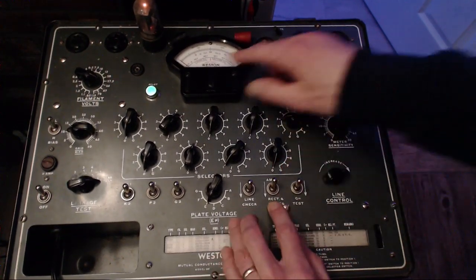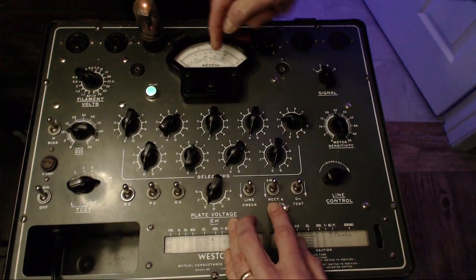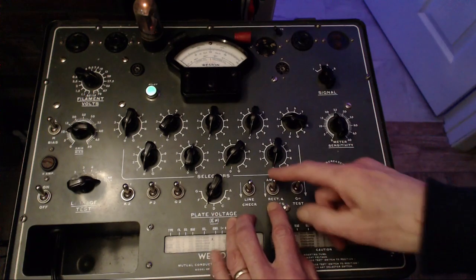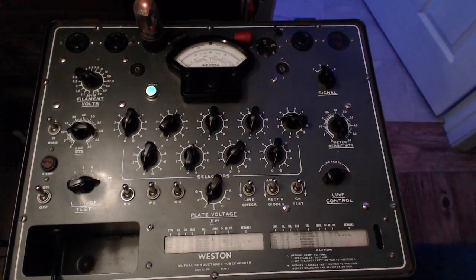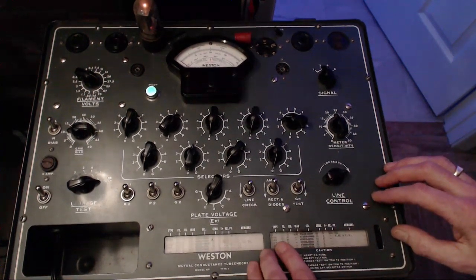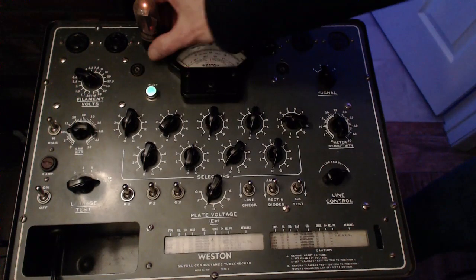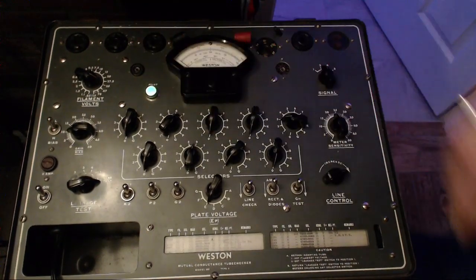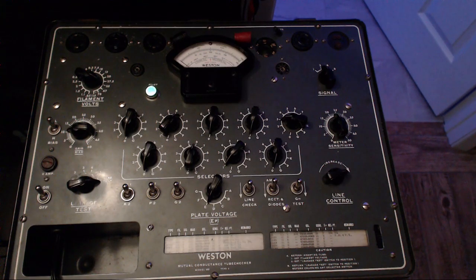And where does it have to come? This is a rectifier. It's supposed to make it all the way up to this area here where it says rectifier is okay. Ooh, rectifier is okay. And there's nothing else to it. 35Z5. That's it. No surprise there. I mean, the radio itself is a pretty strong test of the tubes.